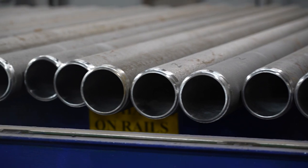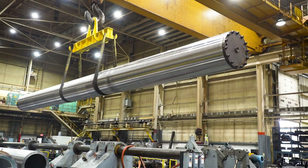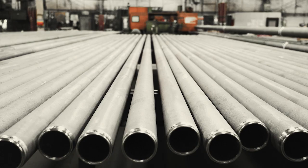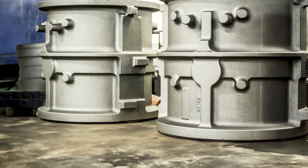This results in a defect-free structure without cavities or gas pockets. Metal Tech manufactures a diverse range of sizes, with horizontal centrifugal castings up to 5 feet OD, 36 feet in length, and 128,000 pounds, and vertical centrifugal castings up to 15 feet OD.